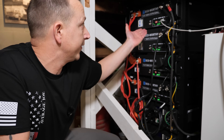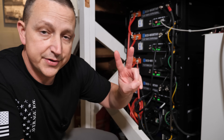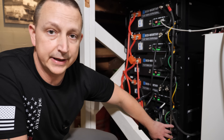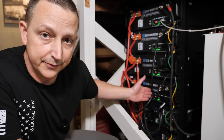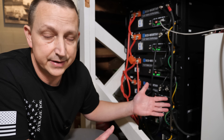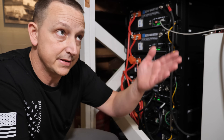The first set is the EcoWorthy server rack batteries — I have four of them here, two are version two and two are version three. I also have two OUSC server rack batteries at the bottom which also communicate with the EcoWorthy batteries. All of these have the JBD BMS inside. Basically all you have to do is go into the settings and change the protocol to Lux Power.